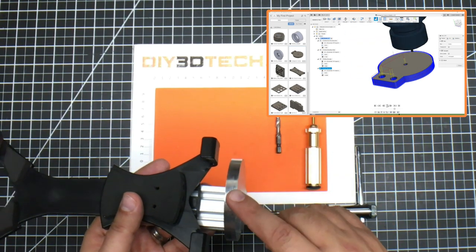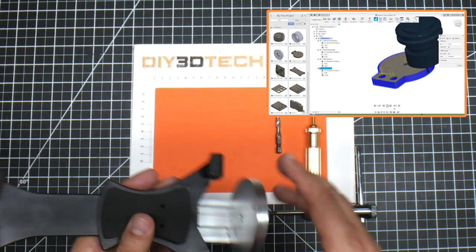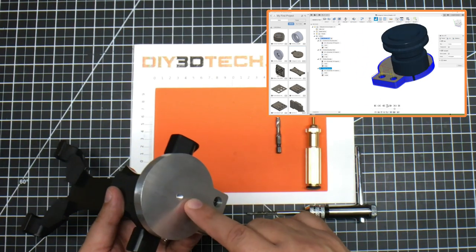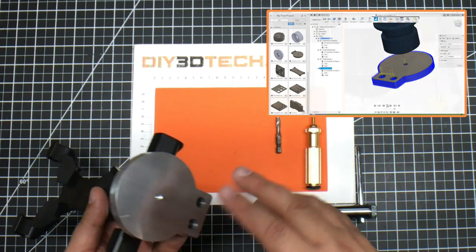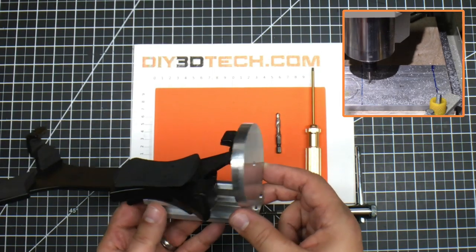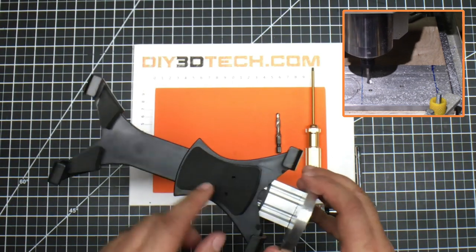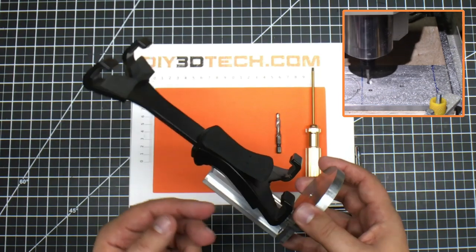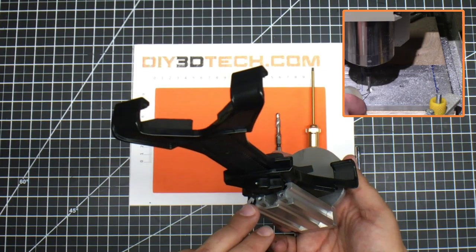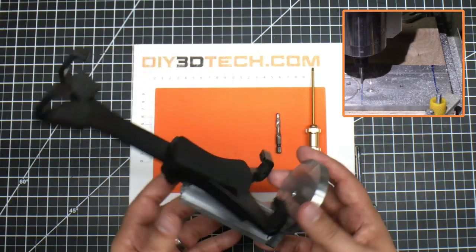It took me about three tries because this is a pretty heavy-duty piece of aluminum, but I intended it that way. When I designed this, one of the things I wanted was number one a quarter-20 opening here, and to have it mate to a 2040 piece of extruded aluminum or maker rail. I drilled two holes and passed in two M5s with T-nuts into the back to mount this. I'll also 3D print some end caps to go on here to finish it off and make it look nice.